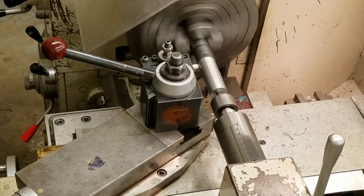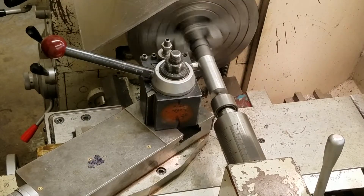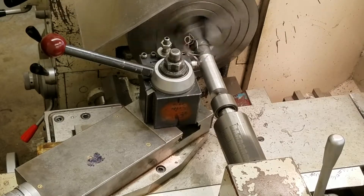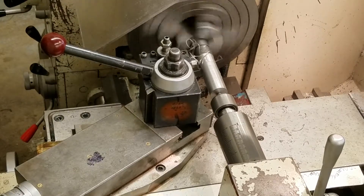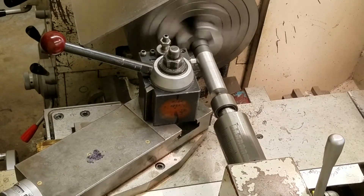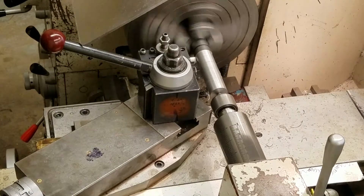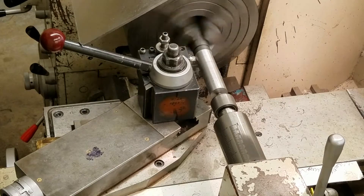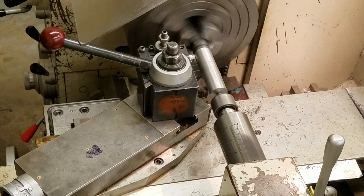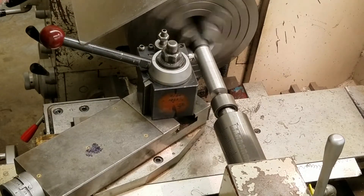From the PowerPoint, our feed rate for roughing should be 10 to 20 thousandths, and for finishing 1 to 10 thousandths. Our depth of cut for roughing is 30 to 60 thousandths, and 5 to 30 for finishing — or whatever you need for finishing. We're not going to do all of it here because it would take too much time. I only have so much room on YouTube. We're going to take it to the line, and I know I'm overshooting quite far.